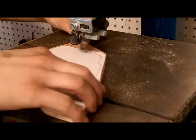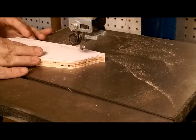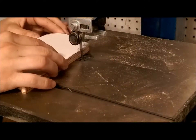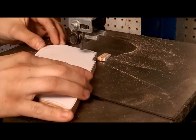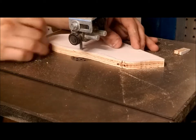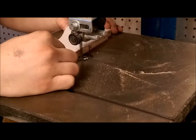Here, as you can see, we are just cutting out that pattern on the piece of plywood. We went ahead and attached it with spray adhesive, and basically just taking really small cuts here, because it is a lot easier to take more wood off than put wood back on. This does not have to be exact — I am basically cutting it down to about a millimeter, and then I will finish the rest off on the sander.